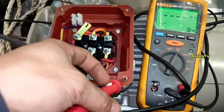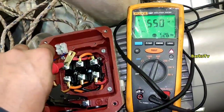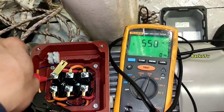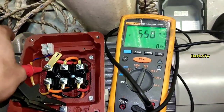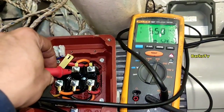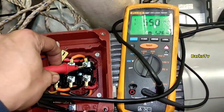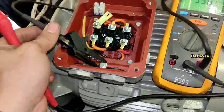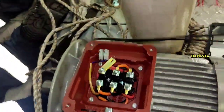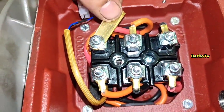Connect to the body — zero — then check individual line windings. The reading is 550 megaohms. All individual lines read 550 megaohms. It's good — our new motor is good. Then we need to connect the spare connection.